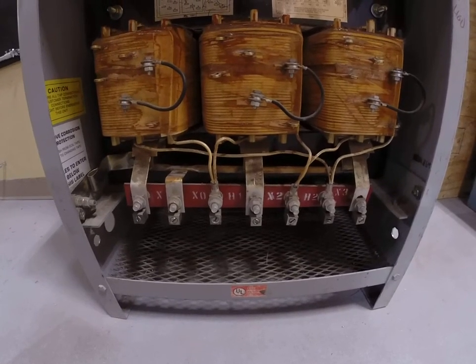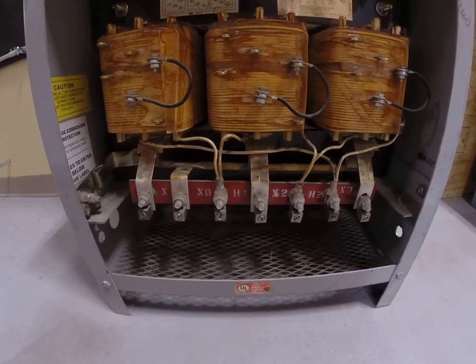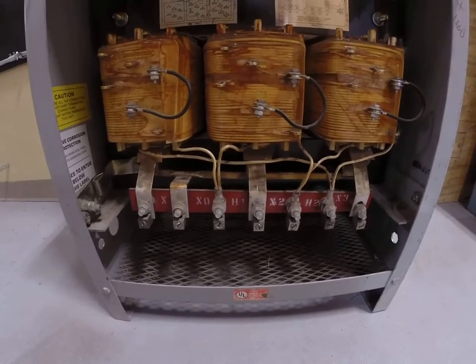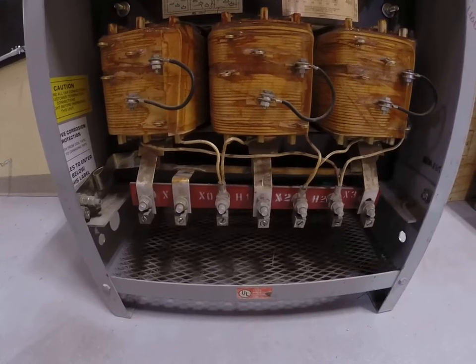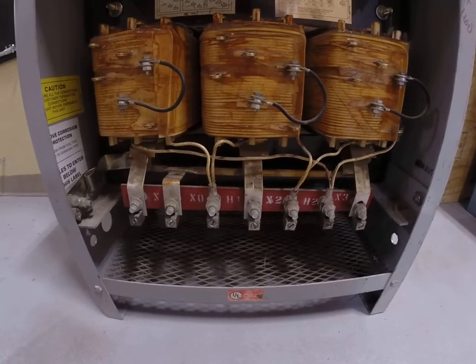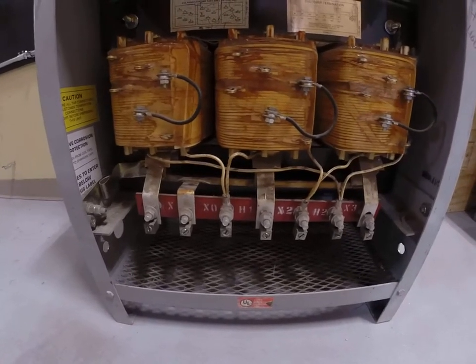So when we had the course on installation of electrical services, we talked about how the main bonding jumper can only be at the service, that green screw. So if you had a sub panel, you'd have to take that out. Well, this is similar in a sense that we're taking power from the main service or some distribution of that service to feed this transformer.